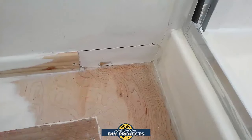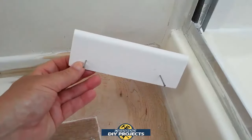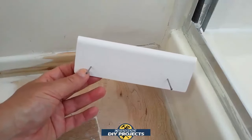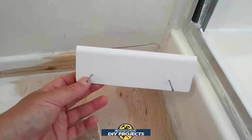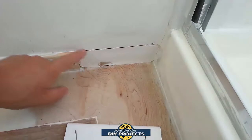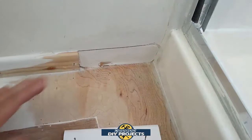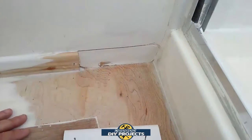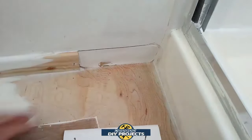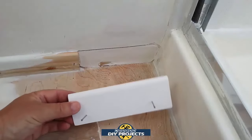I smoothed it all out and marked where I'm going to be filling it in with the little trim piece. I cut that out and have it ready to go. What I'm going to do now is put a little bit of caulking behind it to act as a glue and bonding agent to hold it in place and fill in any possible voids. It's easier to attach the nails ahead of time that way you don't have to struggle with holding the molding and nailing at the same time, especially in a tight area. I ran a line there to make sure the floor was level and the molding was going to be level and not going either uphill or downhill.